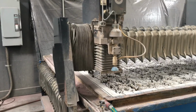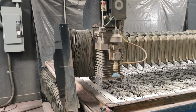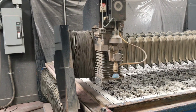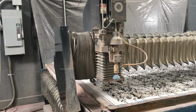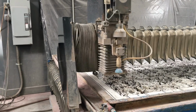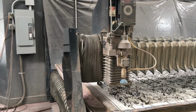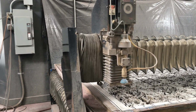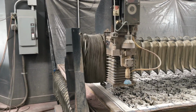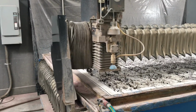The reason why I stand here like this is because I've seen my water jet in particular, when it goes to home that out, I've seen before where my linear bearings were slightly off because I probably ran 2,000 hours before doing an alignment on it. So I've seen it before when it goes to correct, and the right side bounces back. So you catch it immediately, and nothing can even happen. No damage. I always recommend having your hand on these stops. Okay. And watching carefully, yeah.